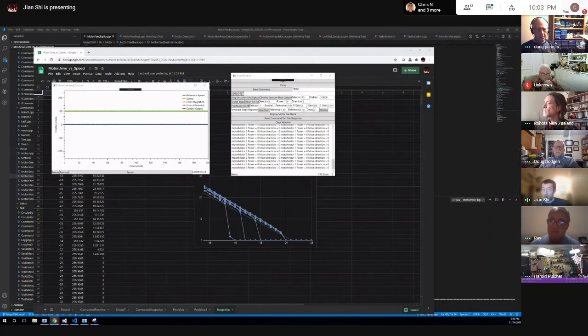Yeah, I think that's my plan too, but I want to make it as good as possible, able to integrate its own position and figure out roughly the right location. Well, first task is to go in a straight line. Second task is to go in a straight line, turn, and come back, because the turning will tell you pretty quickly how good your heading is. Because when you turn, if you do it completely under PID control, it's going to do something like this.